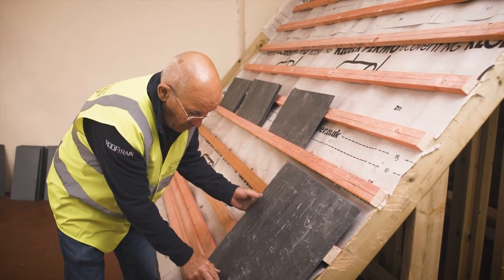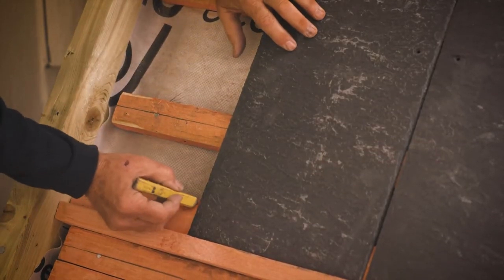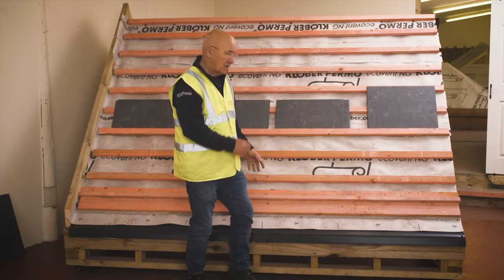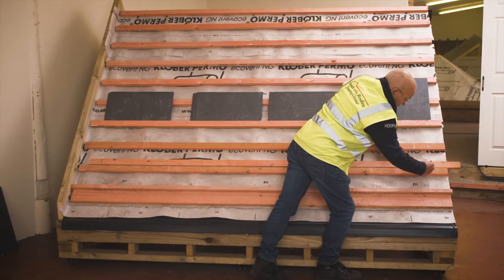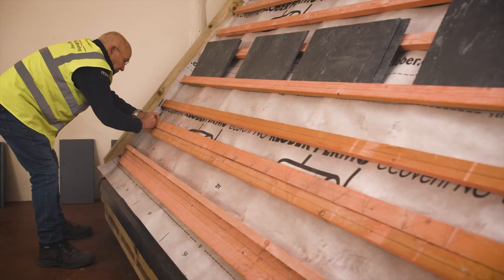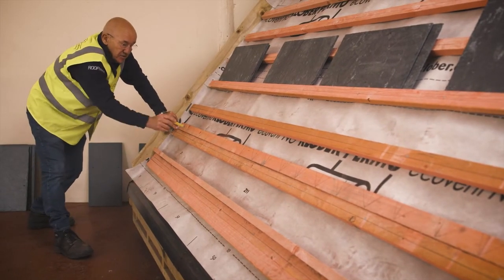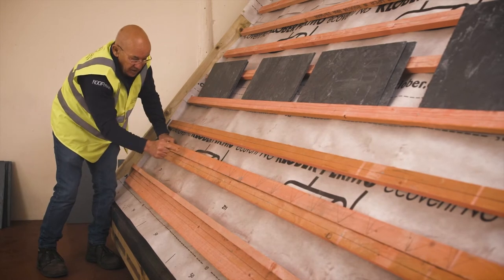I'll put these slates on with a three mil gap in between all the way across. When I get to the other end, I'll mark the slate off, take a slate off, and mark all the way across till we get to the slate and a half — I'll mark that. So I've got my two sets of marks on my marking stick. All I need to do now is move it up and on the bottom put an arrow. What I do on the end here, because there's a bit of batten left over, scribble that out so that I don't start from the wrong end. The reason for putting the arrows there is because when I put the batten onto the actual roof batten, I know which way up it's got to be.